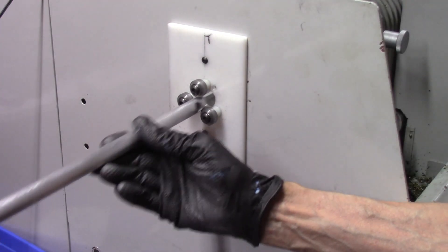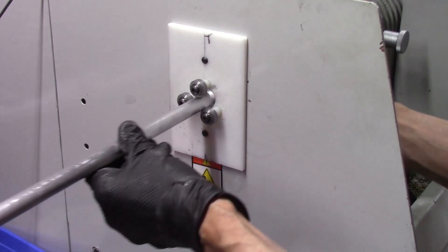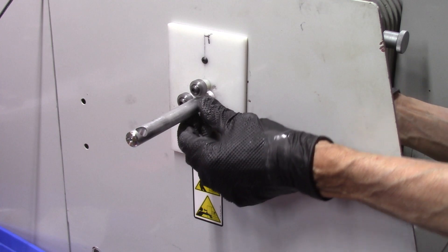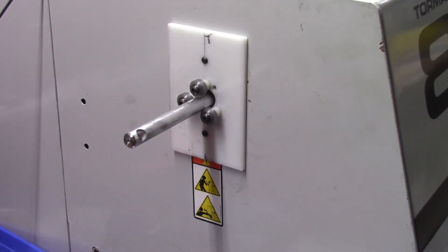Here I am demonstrating the loading of one of the bars through the roller bearings and into the collet chuck on the lathe. When the lathe was operated, the whipping action was eliminated and I was able to machine the ends of the bars with no adverse effects or excessive vibration. This temporary first design worked out quite well, and I was able to machine all the ends of the rear support bars using the Tormac 8L lathe at speeds up to 2500 RPM.